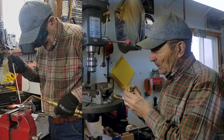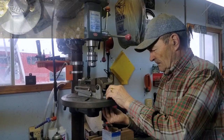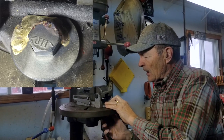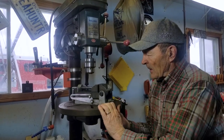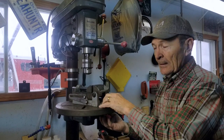So now, when I put the bolt in, it sits against the flat of the vise. I put the washer on the bottom with the wing nut and get the wing nut done up. That flat section of the washer fits tight against the flat of the vise, and I don't have to touch it at all. Just hold it in the position, tighten it up like so — as much as I want. The other end, the same thing. Now if I want to reposition it or take it off, I just reach down and undo it. It doesn't turn. Just that easy.